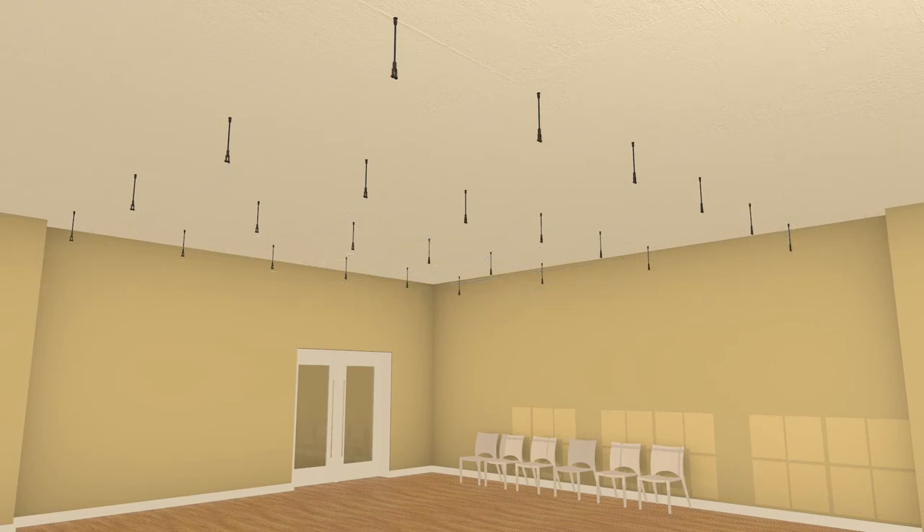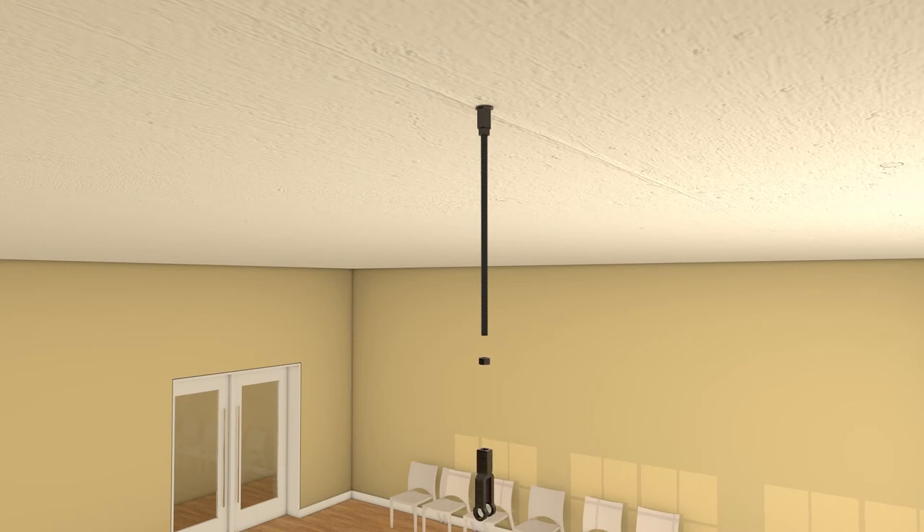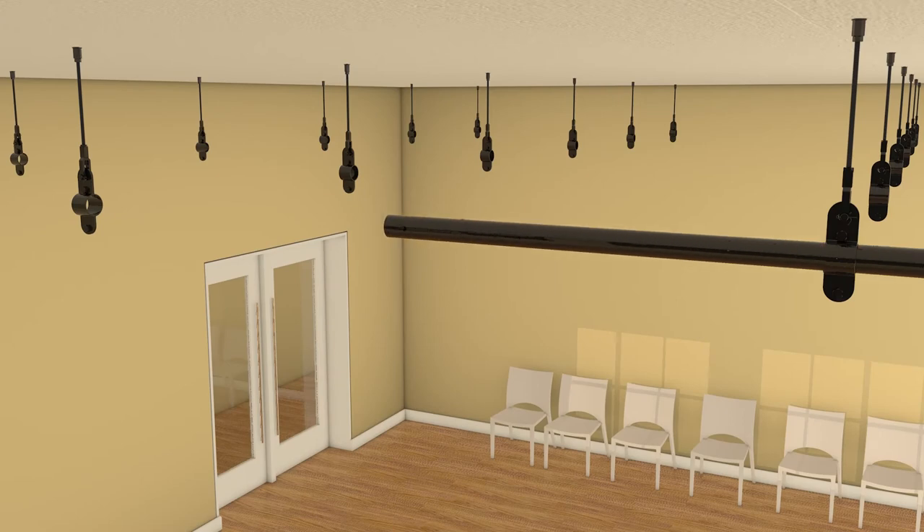In this example, we are creating a suspension point using a threaded rod which is connected to a concrete stud anchor using a coupler nut on top and an internally threaded clevis fitting on the bottom. Pipe clamps connect to the bottom of the suspension assembly and clamp to primary grid pipes using two 3⁄8-inch bolts.